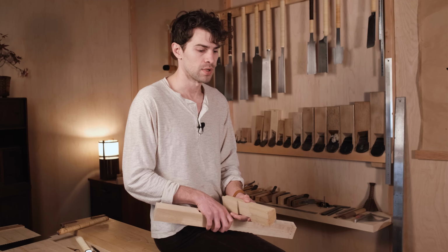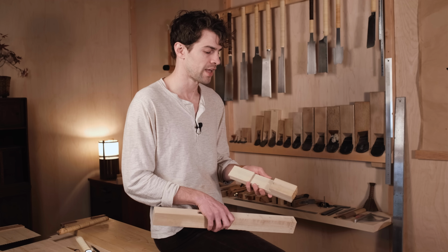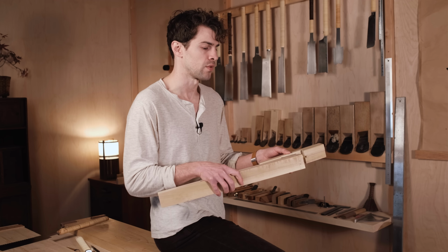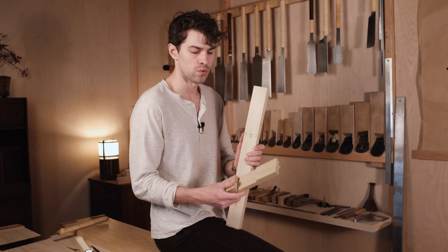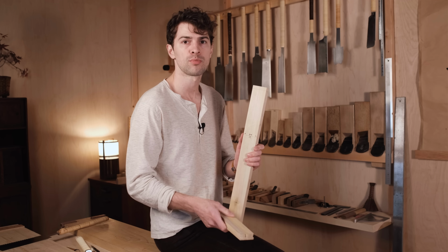In my next video, I'm doing a project where I'll actually be using this joint to join two long pieces together because my jointer is kind of small. So by using two shorter pieces of wood, I can joint them on my shorter jointer bed, get them nice and flat, and then I can join those two end to end so I can make a long 8-foot piece out of two 4-foot pieces. This joint is really cool. There's so many different applications for it, and it's a fun little practice.